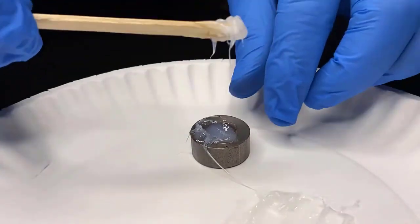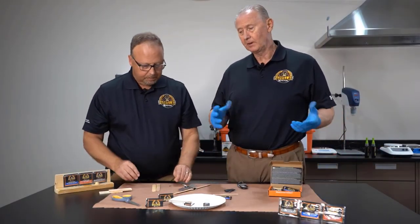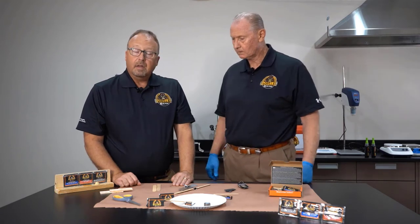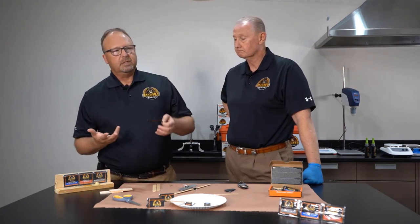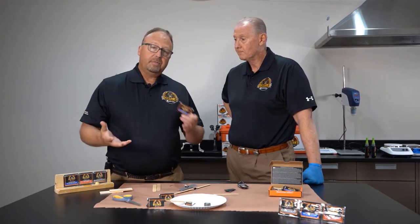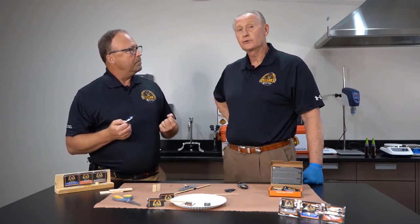The third product in our line is our fast-setting urethane, the PU3. A lot of times you have urethane parts, plastic parts, rubber parts, leather, or most importantly, dissimilar parts — like bonding rubber to glass or stonework to rubber. You're going to get different levels of thermal expansion and contraction, and those materials are going to move against each other. So you want something that has not only the strength to hold those two substrates together, but also the give and flexibility. With this one, Part A is on one side, Part B on the other — push it down, cut it open with a knife or scissors.